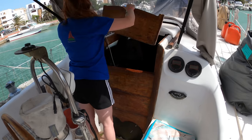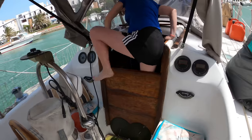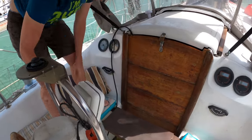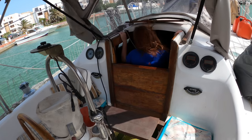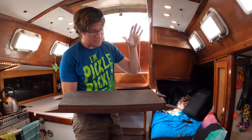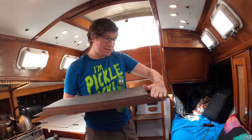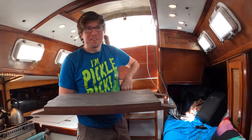One challenge of living on a boat is just getting through your own front door — you have to take out slats and there's often a big treacherous step in the cockpit. Herbie devised a fabulous plan to make that easier. This is our cockpit step: a really big piece of mahogany on two mahogany boards, glued and screwed together. A nice bevel slides under the cushion so you don't have a lump when sitting, and you have a nice sturdy, very strong step.